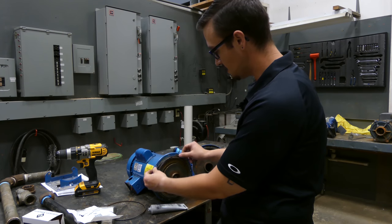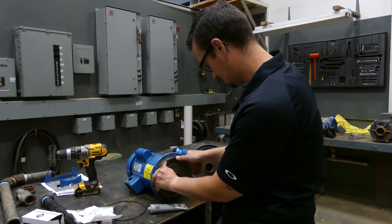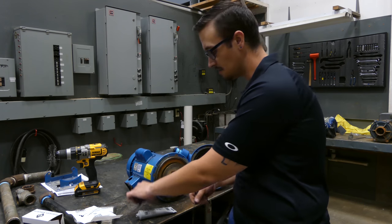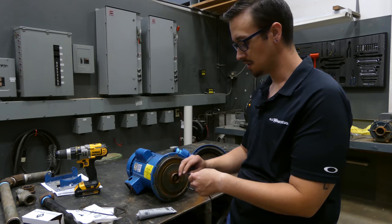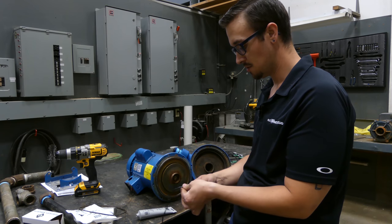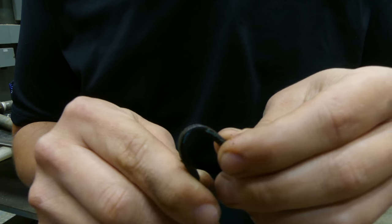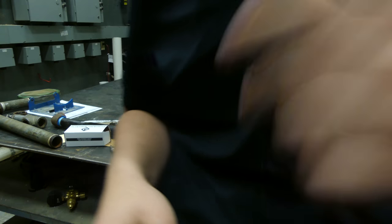So now we've got our new gasket. Before we do anything, let's first make sure it's going to fit — looks like we're going to be in good shape, nice snug fit. I like to put just a little bit of lube on the gaskets to prevent them from getting really dry and nasty. That original gasket is really dried out and almost crunchy — you can see the rough shape that O-ring is in, it's got tons of cracks in it, and it just crunches as I turn it. That's undoubtedly where the leak was.